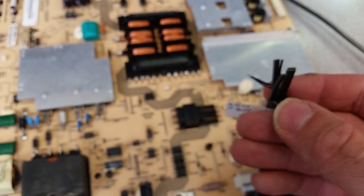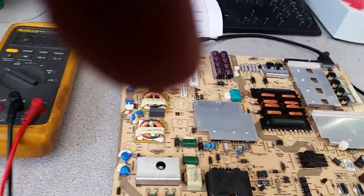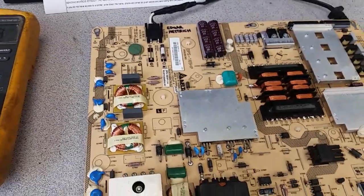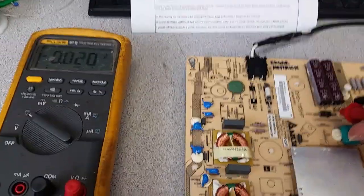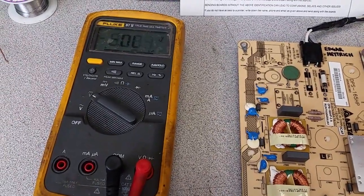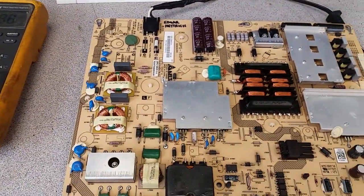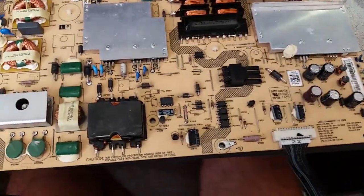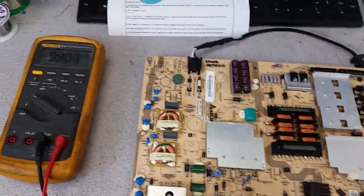Before that happens, it has those two just jumped here, soldered. Before those are connected, I apologize for my video, I gotta get a better camera. The main filter capacitor has only 160 volts here. This is what can be measured. And when the connector is turned in, the voltage jumps to 400 and above. Another thing that can be measured at this time after the connector is after those two pins, and this emulates the main board telling the power supply board, wake up, we gotta work.